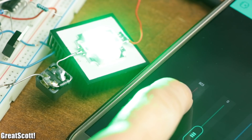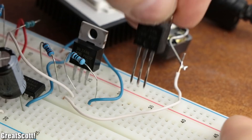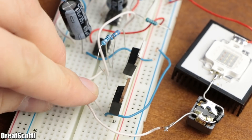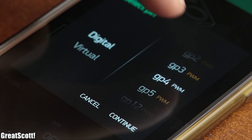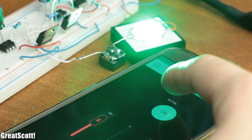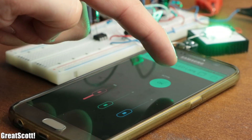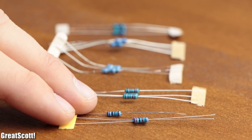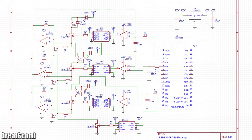One remaining problem was that the LED can never be turned off completely with my design. So to fix that, I added a second MOSFET between the 1 ohm resistor and ground, as well as a power button to the app, which turns on and off GPIO pin 4. I connected this pin to a separate MOSFET driver, which thus turns on and off the MOSFET and therefore all the constant current drivers. With that done, I got rid of my breadboard builds, gathered all the components for three of those constant current drivers, and created the final schematic of the circuit.